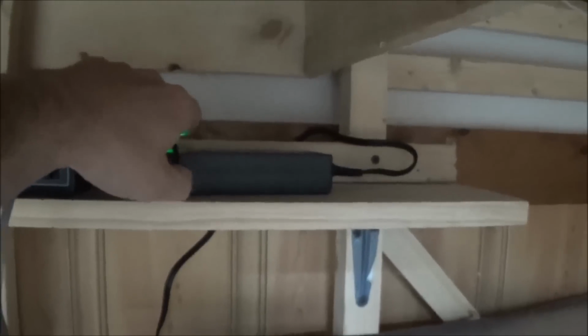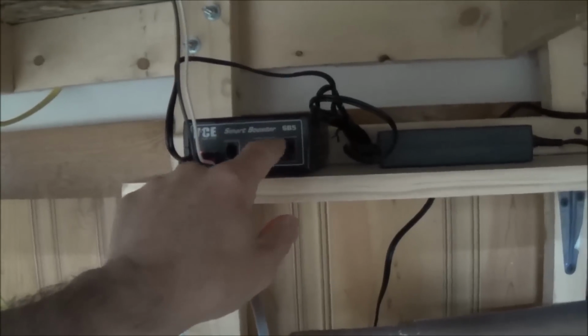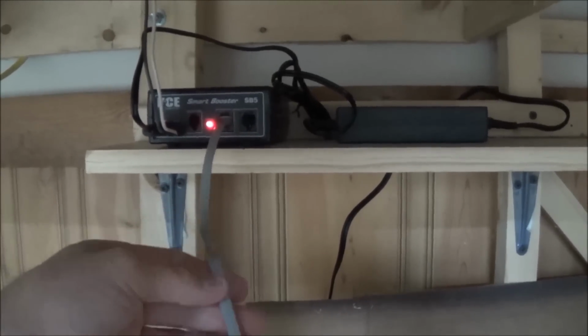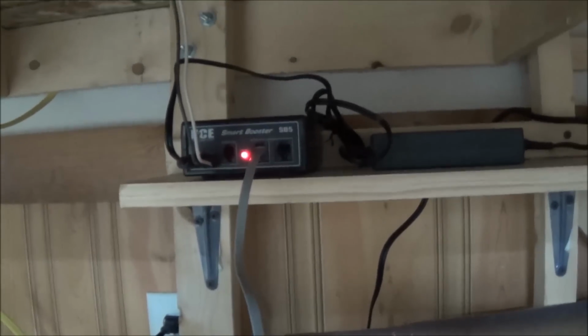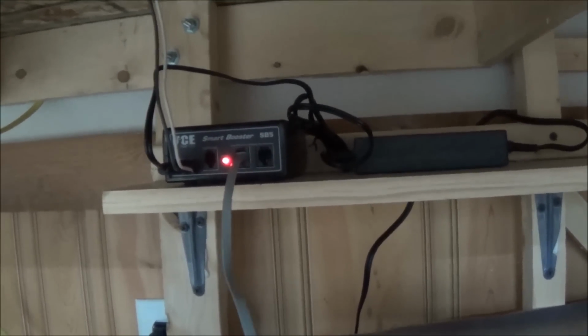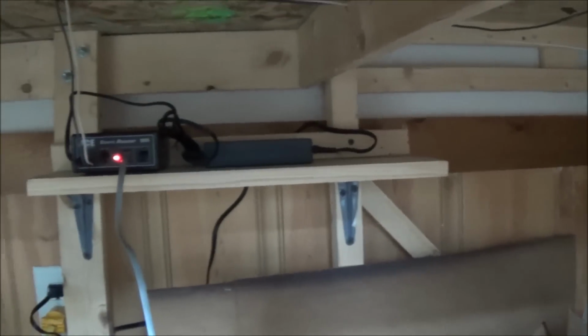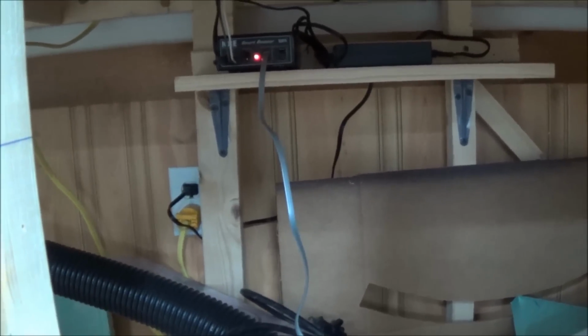All right. There we go. We have juice, and your power supply also has a light on it. Now this RJ12 cable here, it doesn't matter which one of these two you plug it in, but this goes to one of my UTP panels. Another thing, when you buy RJ12 cable, make sure it's designed for this purpose, because it has to do with the way the plugs are on either end of it. If you make your own RJ12 cables, you have to put the plugs on either end in the correct way. And I'll try to demonstrate that.